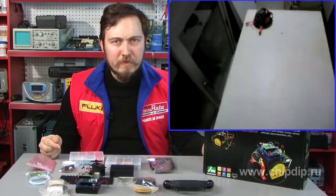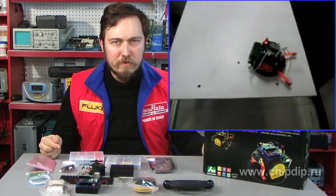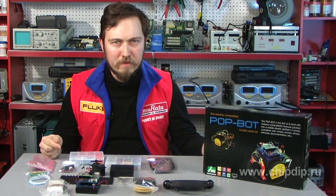ISP port for microcontroller programming, compatible programmers PX400 and PX4000, compatibility with Arduino projects, 16 inputs and outputs, supply voltage plus 3.3V and plus 5V at 50mA.